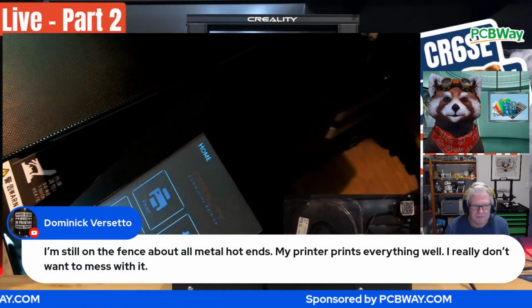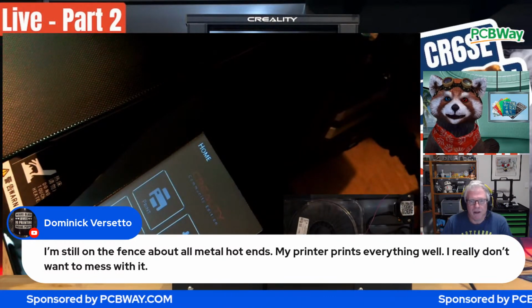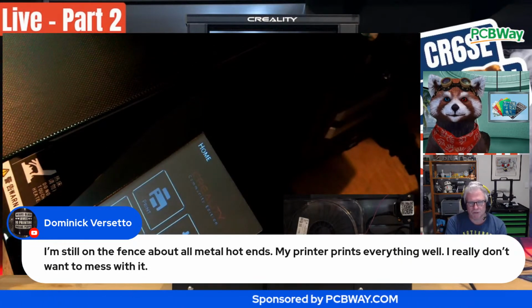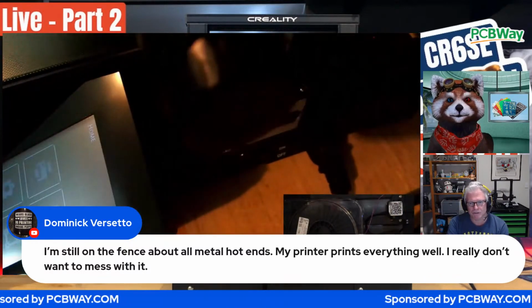Anyone else do that? You just push the filament right through instead of trying to purge it. That's what I do. Oh, yeah. I do unlock and push it through. Pull it back. Push it through a few times just to make sure there's no debris or anything else there to flush it all out. Pick up the odd bit of black from the PTFE coming through as well.